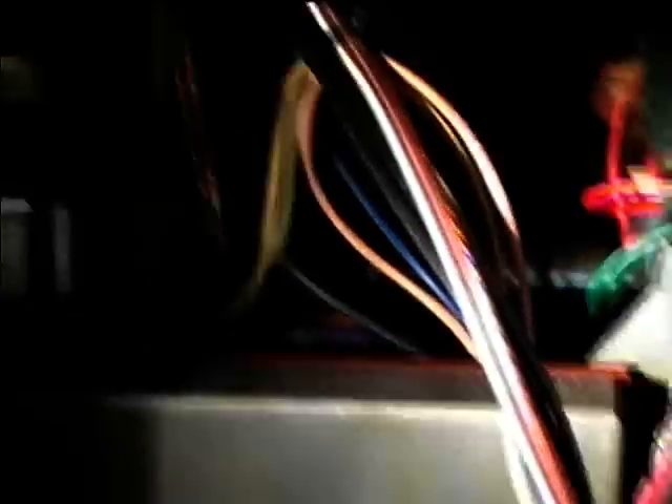Take a look inside of it here. All of the B2 electronics have been replaced with the Trek II solid state preamp and the reverb spring unit. One possible area of concern is this wiring here — it's still got some old rubber wiring right in here. Some of it has been replaced, but some of it hasn't, so that may be something to do to just improve the safety of it.